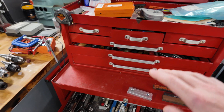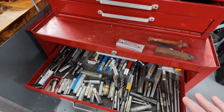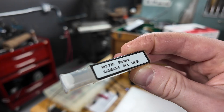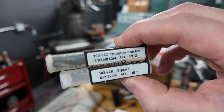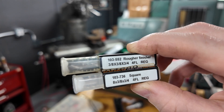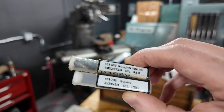I bought a kit — a whole bunch of tools, mills, and everything. It's not organized at all; I need to inventory it. I picked this up thinking it was a 3/8 by 3/4 length end mill, but it's not. The top one is a 3/8 by 3/4 inch end mill. The middle number is the shaft diameter, and on the lower one it seems to be missing a '3' and a slash — because it is an 8 millimeter. That's how dumb that was.